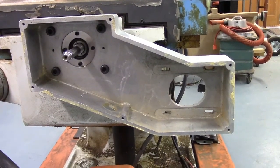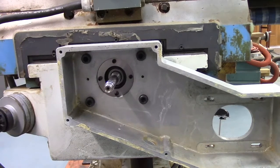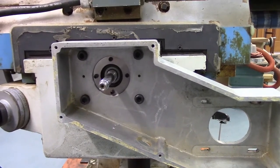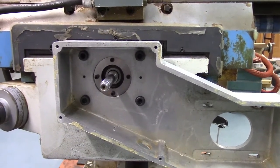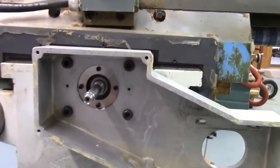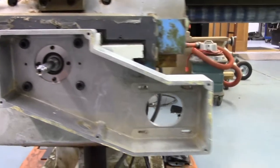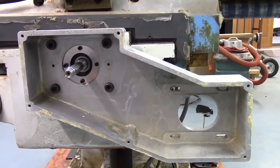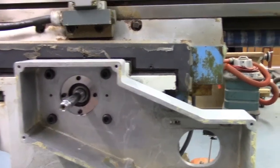Here's a short clip of the Y-axis servo motor housing in place and the bearing pocket flange that I machined — it fit really good. The fit of the housing over that flange was just a light slip fit; it's not loose. It works great. All I've got to do is get some quarter-28 Allen head screws for that, but it looks like the repair is going to work out. I've got a new motor to stick on here, and I'm waiting on a pulley for the motor, then I'll put the pulley that drives the ball screw on and I think I'll have enough play.